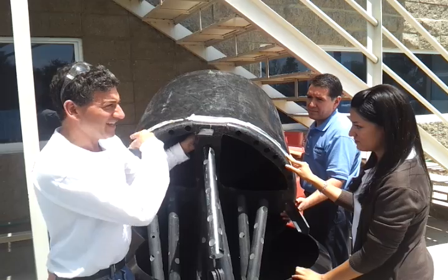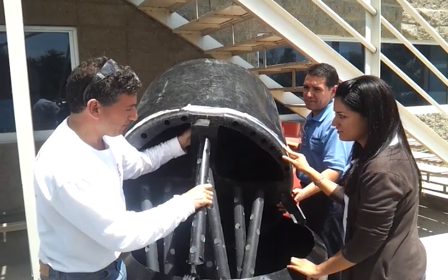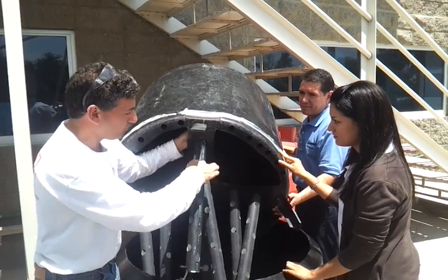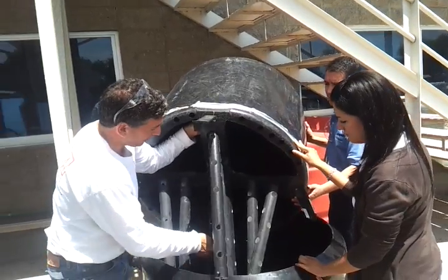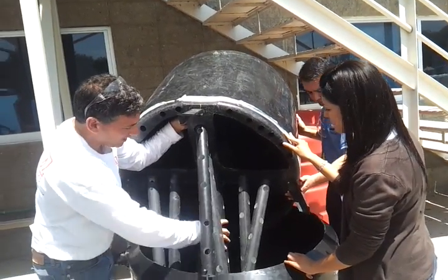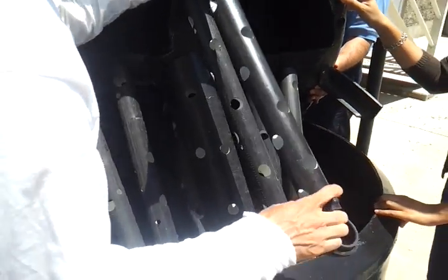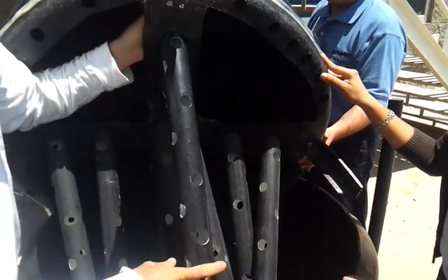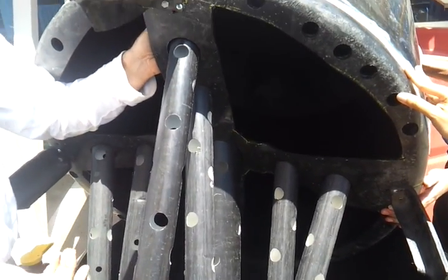Just like you use PET in your biodigestors — it's the same thing. More surface area for the bacteria: food can go in, bubbles can come out. This is open at the top so bubbles can come out. A bigger one in the center because you have a bigger hole — that's a big bunch of hotels, these are skyscrapers. That was our invention in 2009. And now it's come to Mexico, and your own engineers are building it, which is wonderful. You can see how the engineer Ferdinand cut legs here so the inner tank doesn't crush the bottom — a nice new innovation.